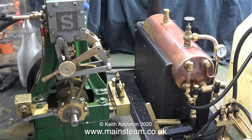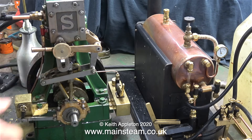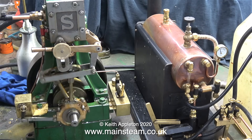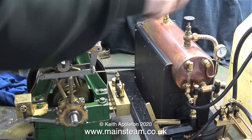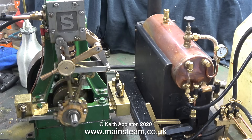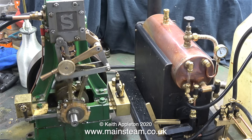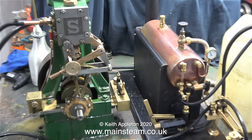When you see a video or film of a steam locomotive, often you can see steam gushing out of the front of the cylinders, and that's usually as it's leaving the station. What that's doing is clearing any water from the cylinders, because on a cylinder of the size you'd find in a steam locomotive, severe damage would be done if it's hydraulic locked.